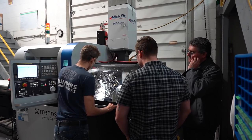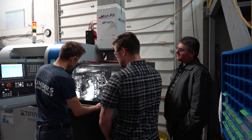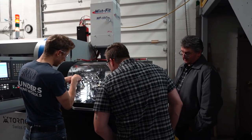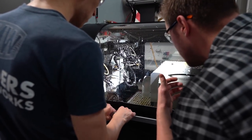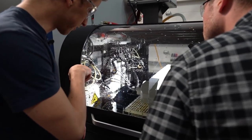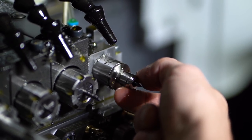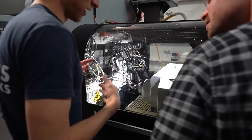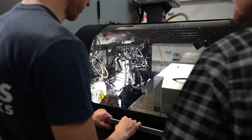That's interesting. So it'll pick that up and physically eject it into the chute and then feed it out, even that tiny little part. Yeah, so you can see in the sub spindle right now, there's a part. So it came and did a chamfer on the back of that? Yeah, I've got one of my live tools right there, that long stick out one, closest to me. I kind of crashed my facing tool the other day, so I had to be creative and use my live tool to spin and face the end of the part off.